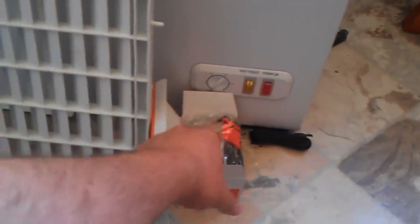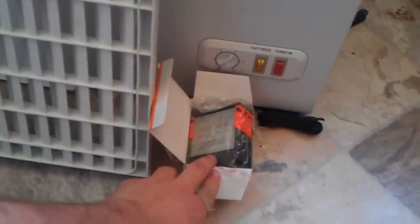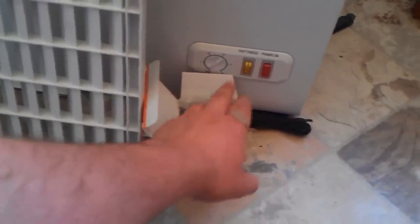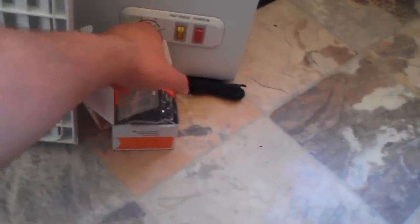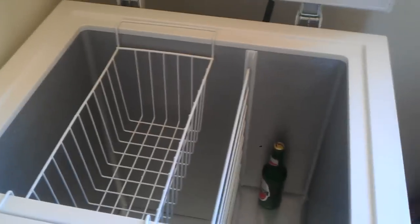The method I'm using, I'm going to be replacing the thermostat — pulling the wires out of the thermostat and placing them into the temperature controller. The traditional way is to turn the whole freezer on and off; in this way we're only adjusting the thermostat that's there, but this will be disconnected. The advantages: the fridge light will still work when it comes on, and the fast freeze will still work down here.